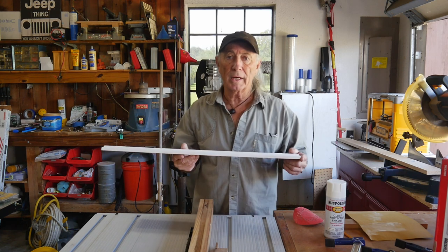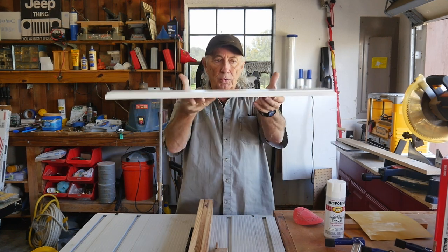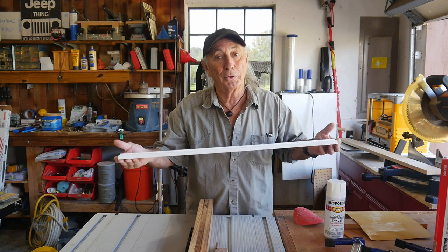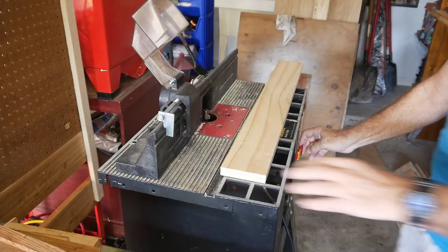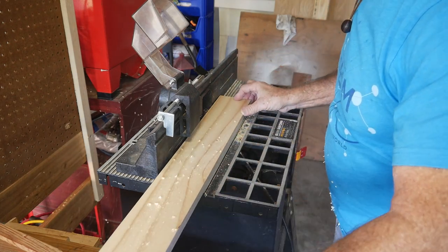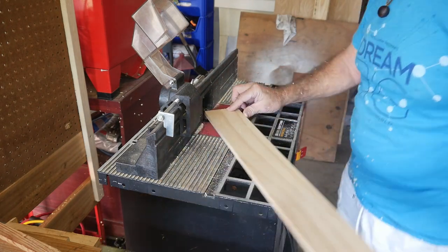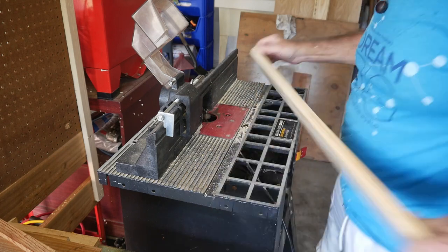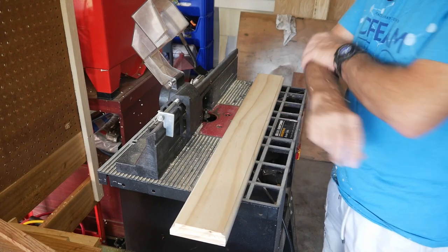Hopefully that saves you guys some headache. What I'm looking for is the lumber curved this way, so that when the two screws pull it down, the ends will be tight to the wall — that's the secret of a good craftsman. Let's go to the router.